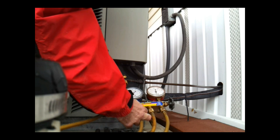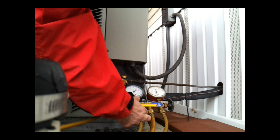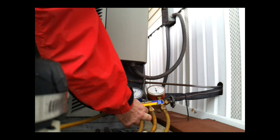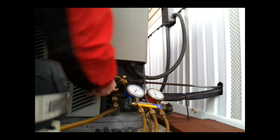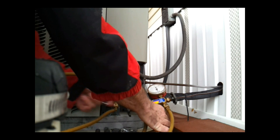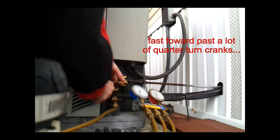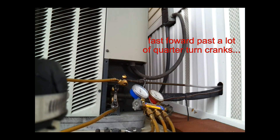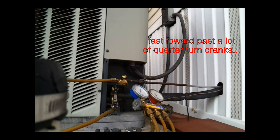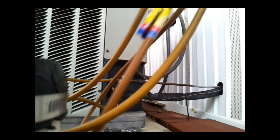You can hear the compressor getting a little pissy, but it's still doing pretty good. My high side gauge is well below, and I'm pulling the suction side over here. Let's go ahead and lock this off. Negative eight, negative nine, and close to ten. There we go. Now pull our disconnect again. The top and the bottom are locked off, still sucked into a vacuum.